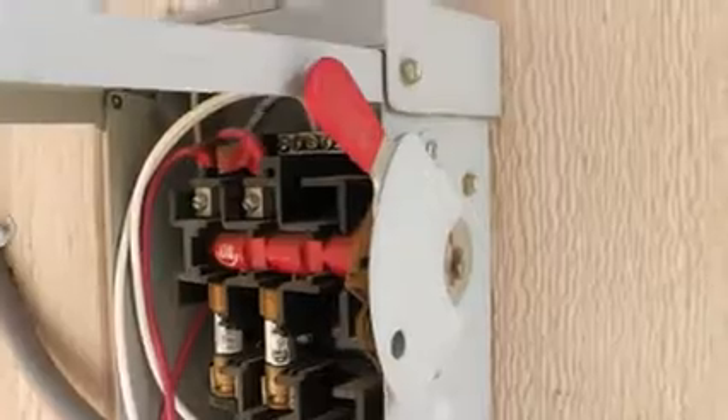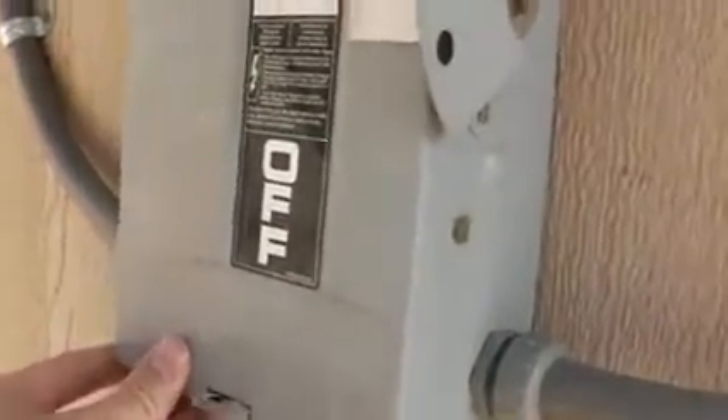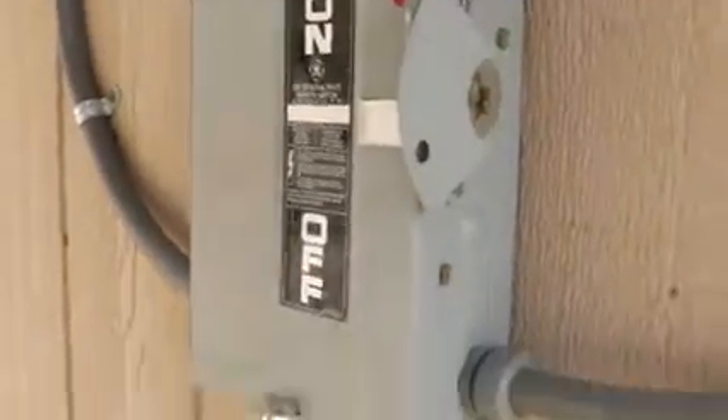This is just your basic disconnect fuse box — nothing special here. But whenever we're working inside, I generally disconnect this so that the solar PV isn't running. Right now the sun is shining, so there's power flowing through these solar panels and through these wires. It's very important to keep that in mind when you're working on your system — if the sun is out, there's power. A lot of times if we're doing maintenance, we'll actually put blankets or tarps over the solar panels. This is important for safety.